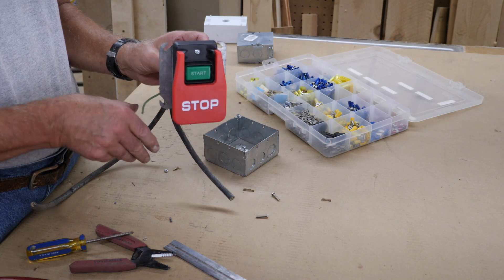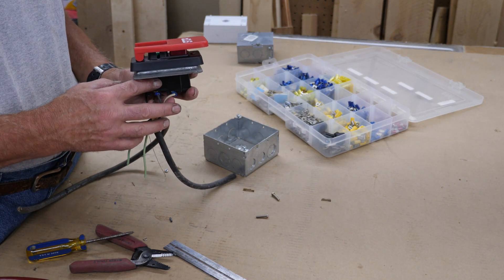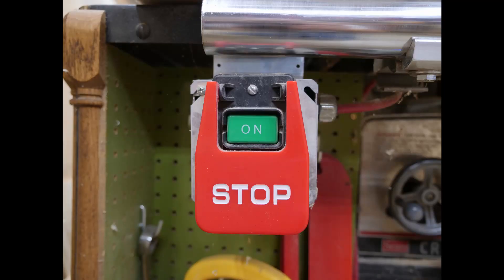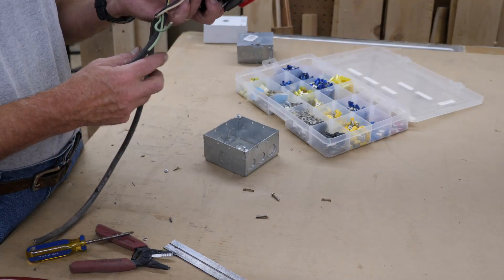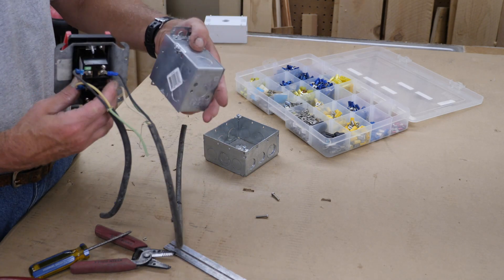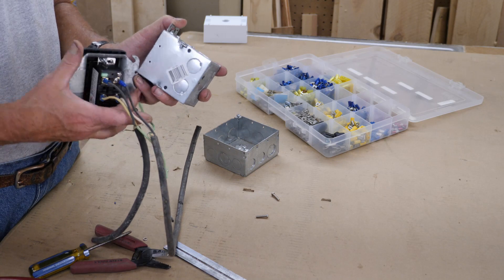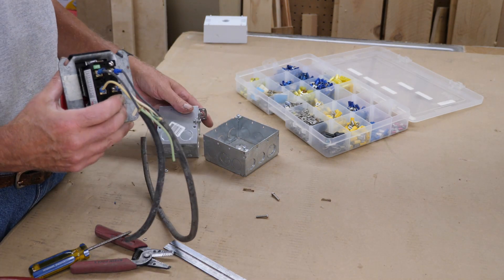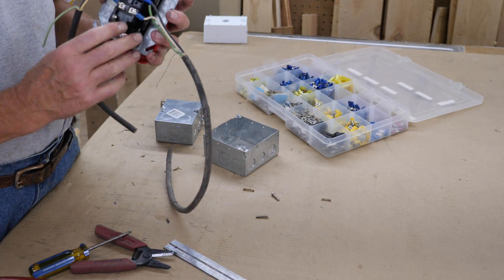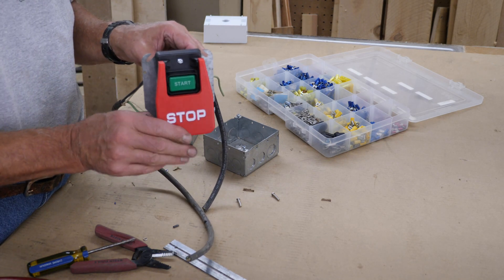And when you're done, it'll look like that — start, stop. If you do not want this little raised part, I would have used a flat plaster ring. You can also turn this plaster ring over the other way and have the flat side out, and then this would sit flush against the metal — like you can see here, like I've done on my table saw. One thing you don't want to do if you're going to use a switch box: how these wires stick out — you may need to bend them to allow clearance past the sides when you go to put this into the box. It doesn't hurt anything. You definitely don't want to do that with a shallow box, because it'll hit the back of the box and you'll end up shorting against the box.